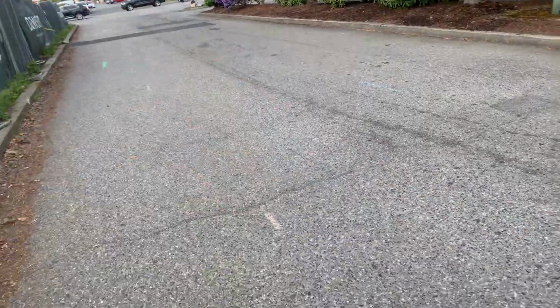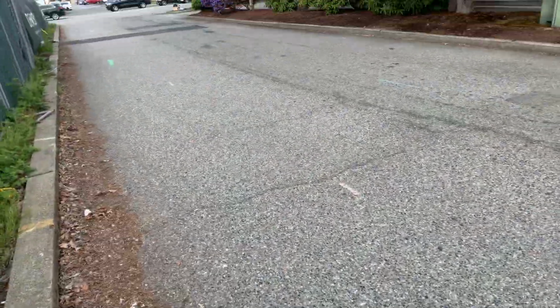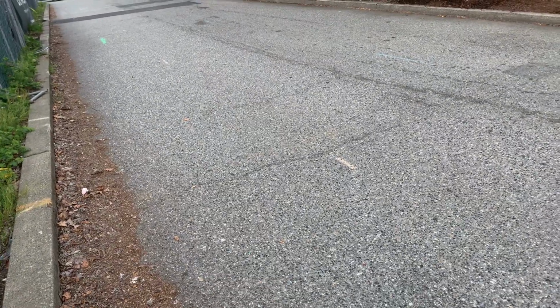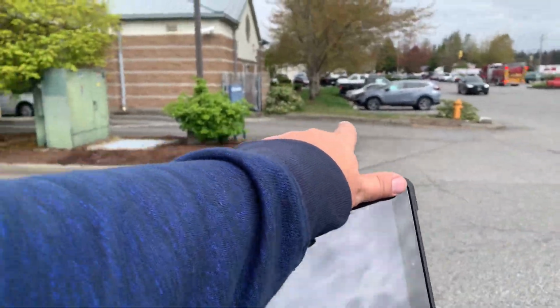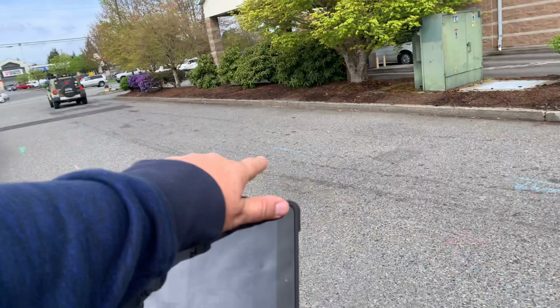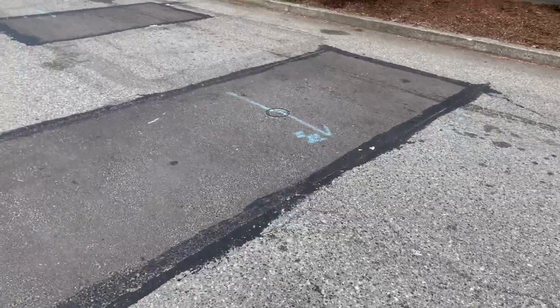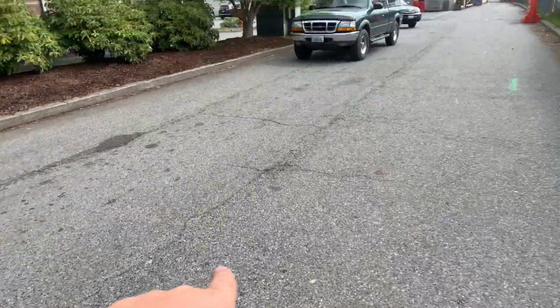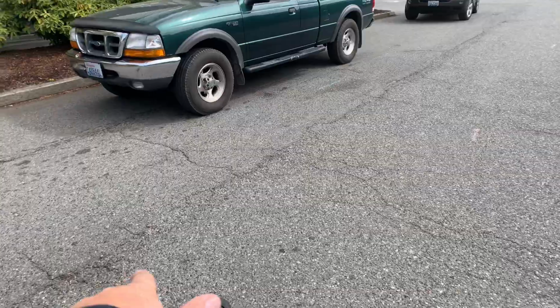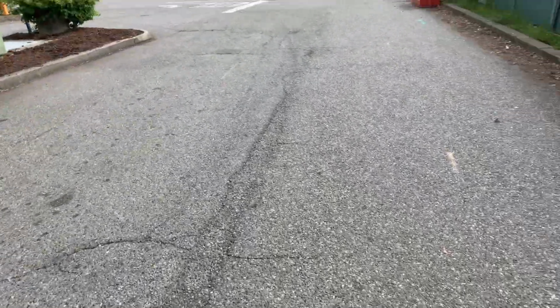And then down the middle we've got alligator cracking that should be repaired as well. So we've got a 5-foot by 12-foot right here, and then down this stretch we've got a 9-foot by 52. We got 52 to this joint here and up to get this alligator cracking. 52 by 10, be able to take care of all of this.